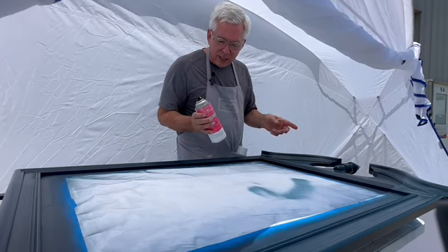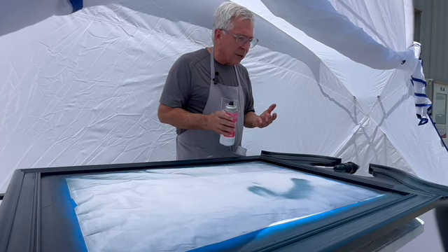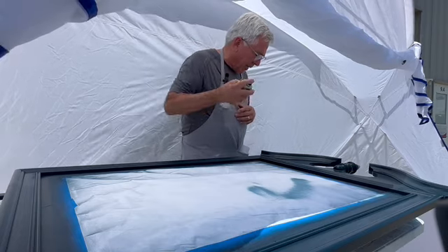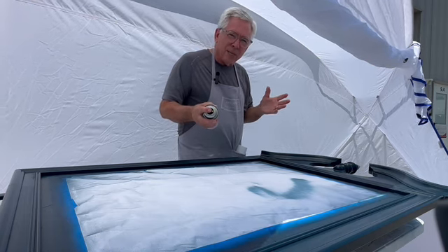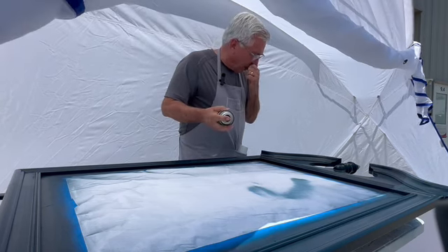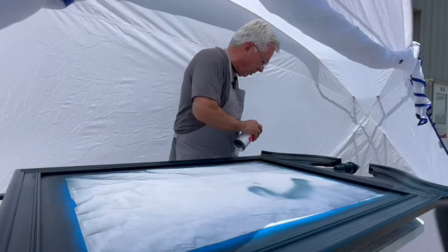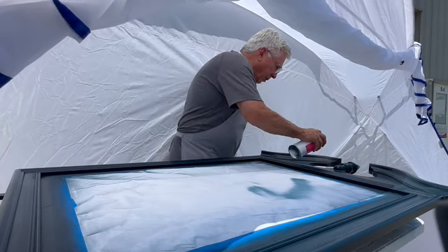Why do we need clear? Clear is not needed to seal this — what we're using the clear for is to give it more depth. We want more depth to our lacquer, which is why we use the clear on top of the Belgian blue. We've got it shaken up and we're ready to go. Notice we're in our little spray booth tent that we set up — it's almost too small, but it helps protect us against the breeze. As you know, if you've used lacquer, you cannot use it in a windy or breezy area because you'll get a lot of overspray. So here we go — about four to six inches on our lacquer.